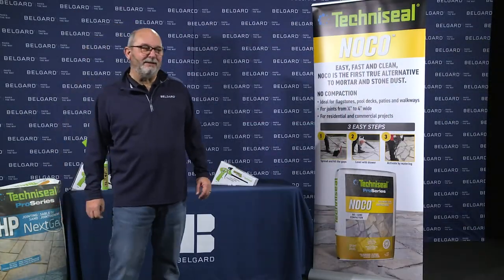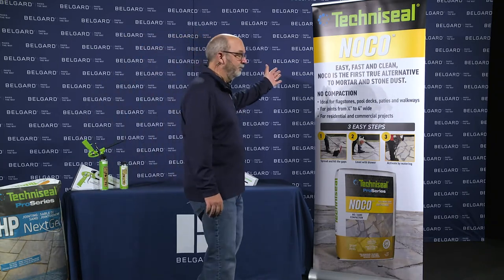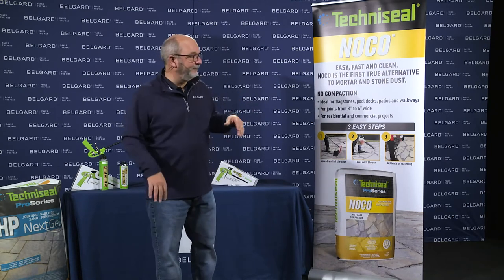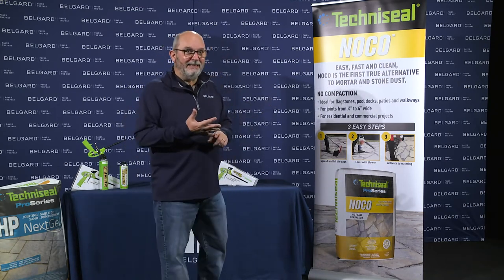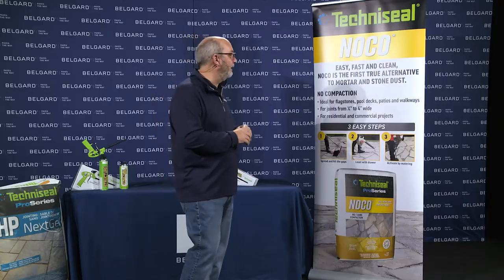Hi, welcome back. The next thing I want to talk to you about is a brand new product from Techniseal, NOCO. NOCO stands for no compaction. It's pretty simple. There's always been a need in the industry for a jointing material that goes in the ground between flagstone. Flagstone being thin, being thick, the intersections being deep and wide. So we're looking for a product that, A, you didn't need to compact, and B, fit in those wide joints, tall joints, deep joints easily.